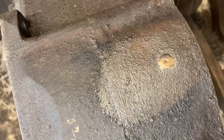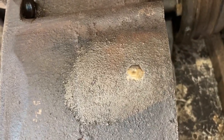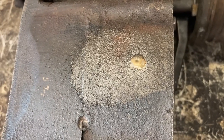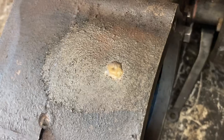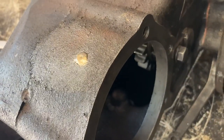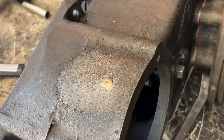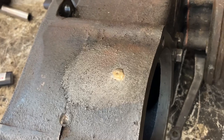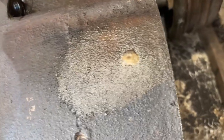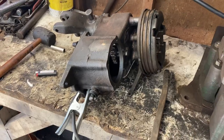I was surprised that with the AC I could totally see it cleaning the metal — just as I was getting the arc into it, it started melting in on itself. It acted like aluminum, so very cool. I'm excited to try to fix the ear on an intake manifold I have to weld together, and I think this is going to work pretty well. Mission accomplished — stay tuned for more.